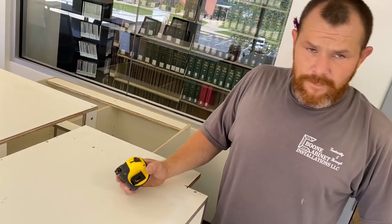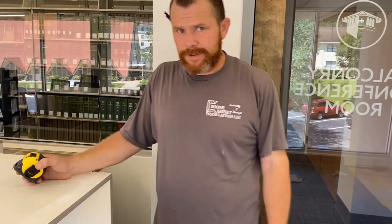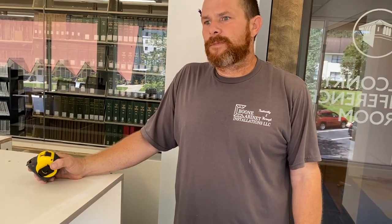Like I was saying before, if you want to cut an extra 1/4 inch off the carpet, you're fine, you're covered. A lot of cabinet brands will use 1/4 inch material. Don't freak out, you can always pack that material out. If you realize that you cut too much carpet and you need to cover it up, get a piece of 1/2 inch or an additional piece of plywood, nail it onto the toe kick, and then put your finished piece on top. Bring that piece out to dress on top of the carpet.